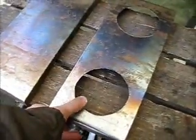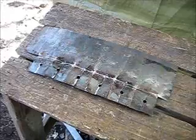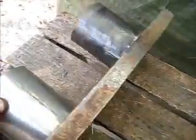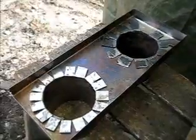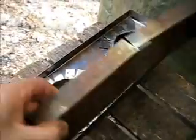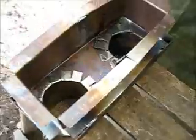Here is the top, the cooking surface. And here is the bottom of the box, with two connections for the flues. This is how you cut the chimney connection — very simple. These holes are not necessary; I'm just reusing some old pieces of metal. This is what the chimney connections look like. There's no need to fasten these on the top plate, because when you put the walls and bend the flaps, the chimney connections will stay there.